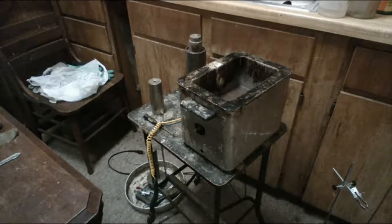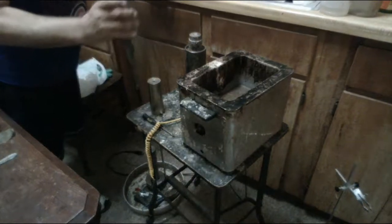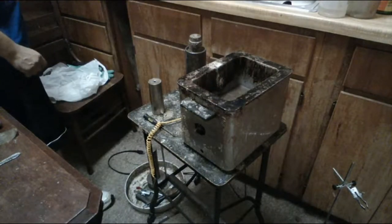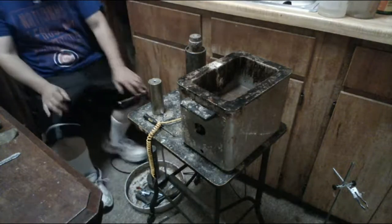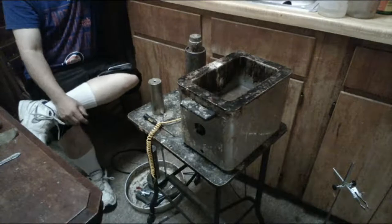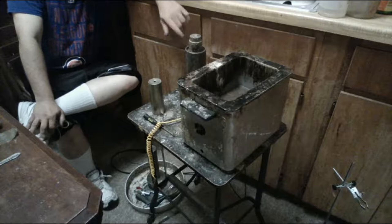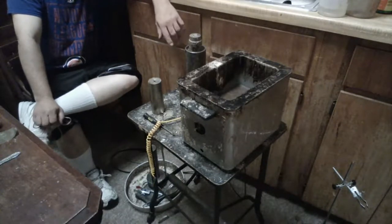What I used for a reservoir was my early mold, my first mold. So this is the outer casing of my first mold. It didn't always make the thickest blanks because you had to shave them down. They were almost around the 2.150 or 2.160 range, which doesn't have as many shaves as these blanks. This mold right now, the inner diameter of the mold itself is 2.4 inches.